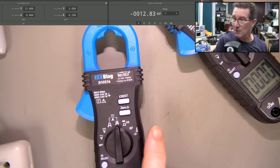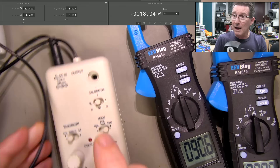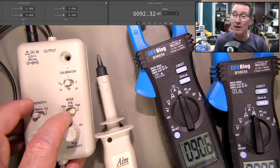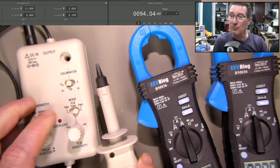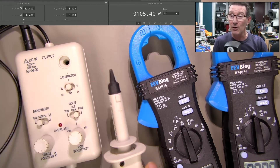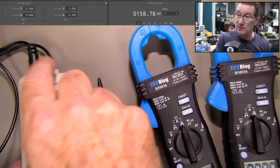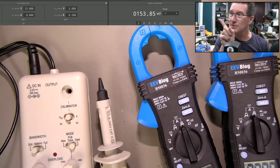What I'm going to do in this video is test to see if this is magnetized. I've got my AIM TTI iProber 520 here. As well as measuring current through PCB traces, it's also got a field mode which gives a DC output. I'm going to put it on 2 Hz to filter out any high frequency magnetic noise. It's got a voltage output here which I've hooked up to my meter.